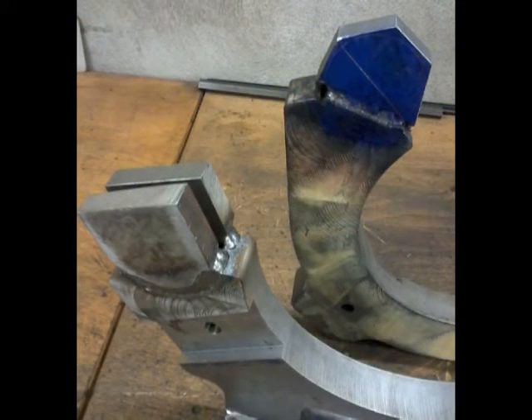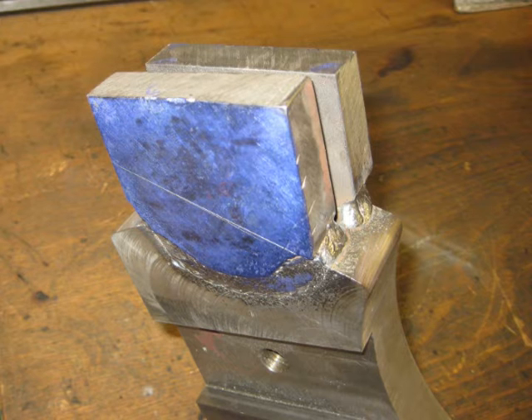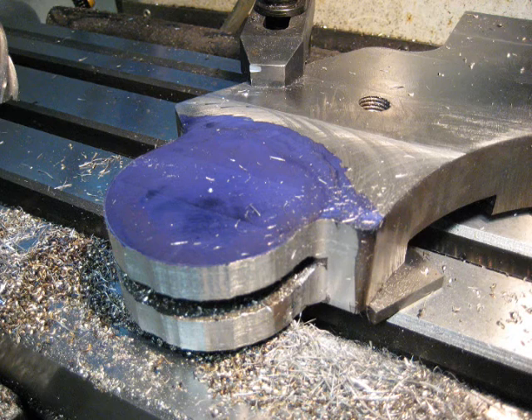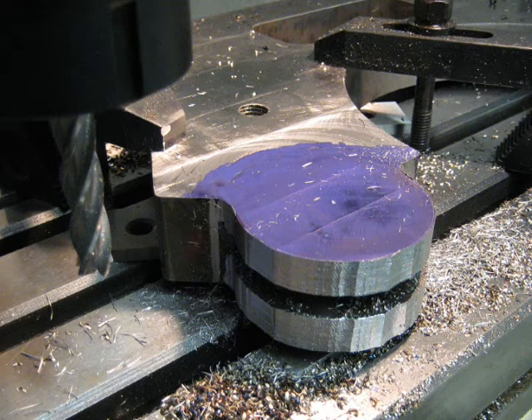Here we are trying to fix the blunder from the start of the project. What I did was cut off the machined ends of both the upper and lower part of the steadrest, then welded on new pieces with room for machining. It would have been much better to use brazing, but I don't have the equipment for that. The MIG weld was really hard, and it was tough going in some places — especially the slot in the lower part was difficult, really deep with lots of hard weld at the bottom. In the end I made it work with a very long carbide end mill.